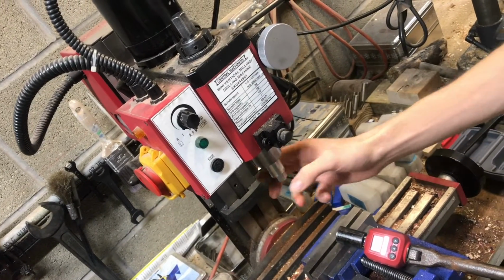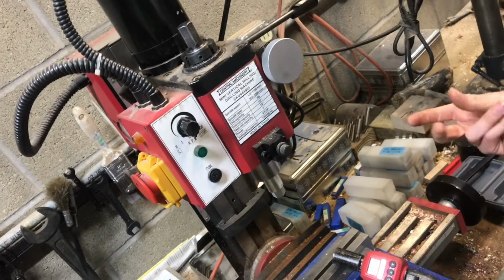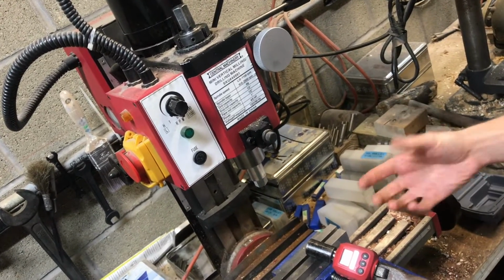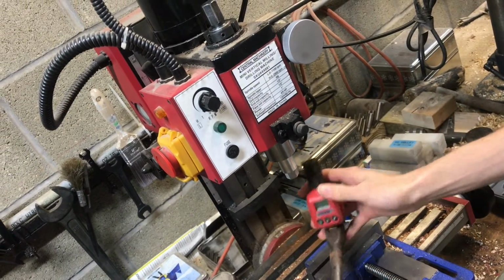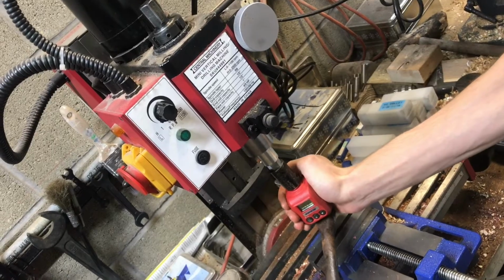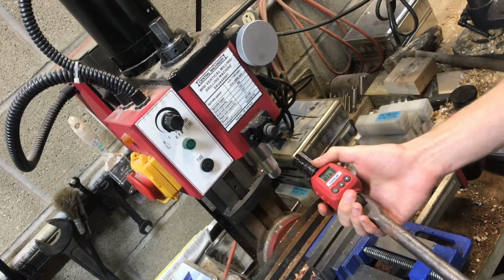The other thing that you have to know about this type of testing is as the workpiece starts to slip in the collet, it may begin to dig in and build up a little bit of the material that's being removed from the sharp parts of the collet. It's going to get pushed out of the way and maybe mound up a little bit. Anyway, what I'm saying is, contrary to intuition, it's better if you do it kind of quick and don't sit there and slowly ramp up the pressure, because you want to take the reading as soon as it slips.